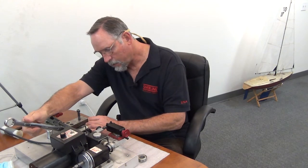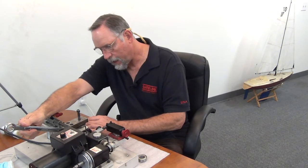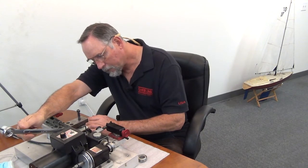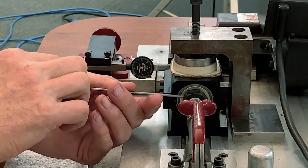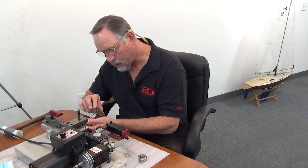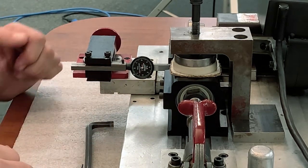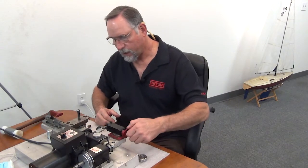I'm slowly tightening it until the preload gets down where I want it — we're getting to about half, then about three tenths, and now about two or three tenths right there. I'm going to tighten the set screw on the side. Sometimes tightening the preload nut will change the reading a bit more or less — that's about three tenths right there. Normally we go about two tenths, but for the video I'll stop right there. That's where we set the preload.